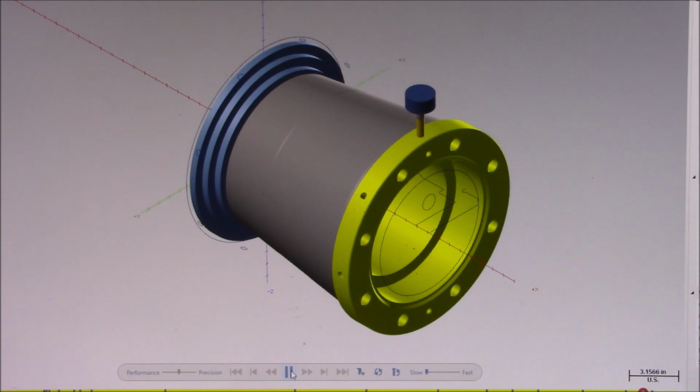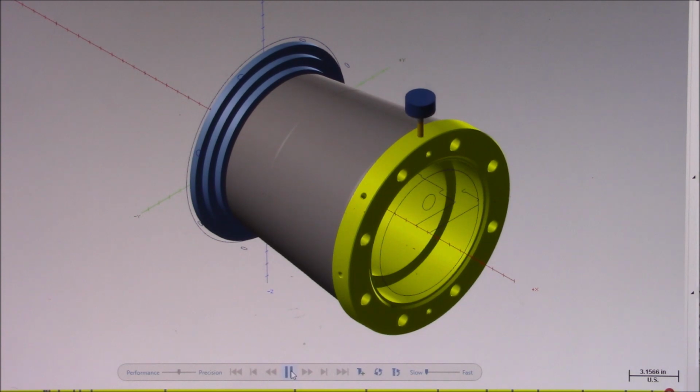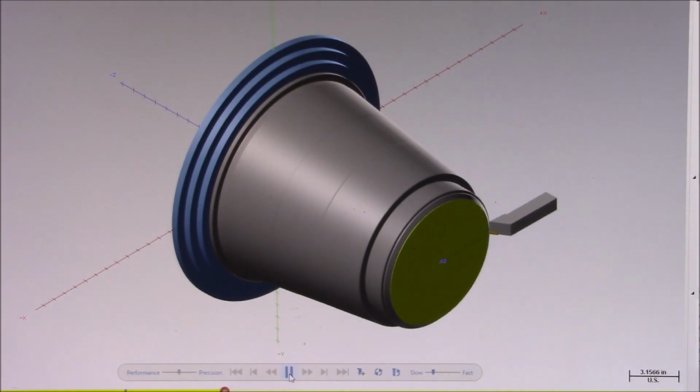The next step after this will be to go back to side A for a third setup. There are a couple of reasons why 3 setups were needed to do only 2 sides of the part, one of which is because of the heat. The other is because we are currently jawed on an area where threads need to be cut. The part will start out with the finished face pass, along with the semi-finished pass on the area where the threads are going to be turned.